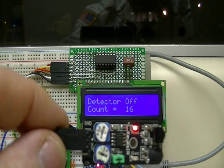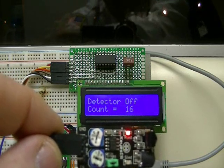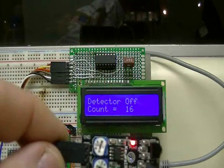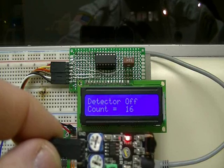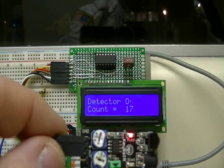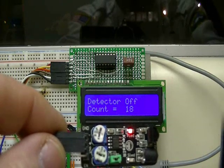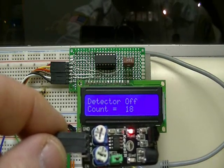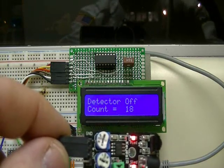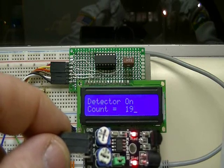One idea that I had would be interesting to try. And by the way, how far it detects depends on the settings of the two potentiometers. I've got it up to three or four inches. It also depends on the surface — if you've got a white surface it's much easier to detect than a gray or black surface. A silver reflective surface works about the best.